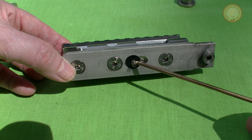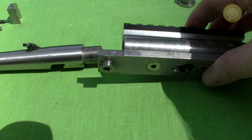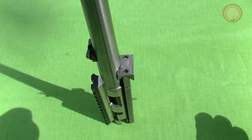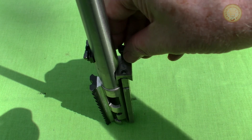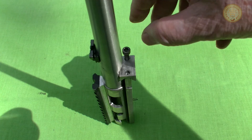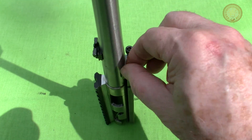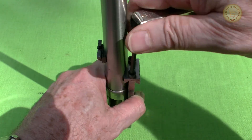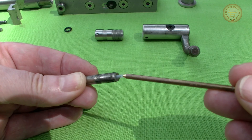On the bottom of the receiver, an insulated plug with a center conductor transmits the electrical ignition impulse to the bolt. The barrel is mounted to the receiver with the same type of system used in the 10-22 and is held down by two high-strength bolts. The body of the igniter is 303 stainless steel threaded to fit the bolt insert, and the Teflon-insulated hollow conductor mates with a wire in the bolt.